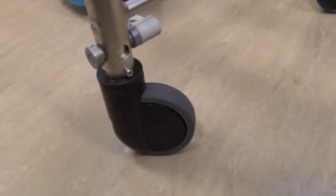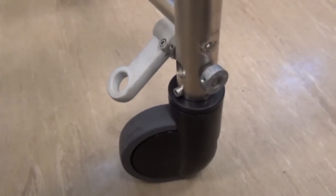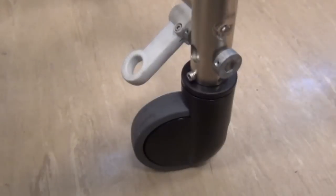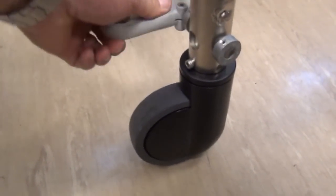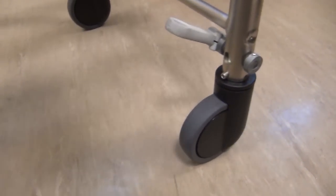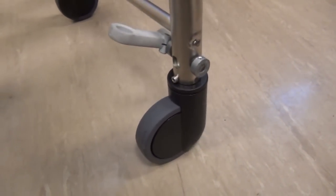The wheels of the casters are designed for rolling on smooth and rough surfaces and are non-marring. The casters used on the lift load have a lock steer feature for ease of maneuvering. The foot switch on each caster has two positions: one which locks the wheel entirely, and a second which prevents the wheel from swiveling 360 degrees. When assembling the end frames of the lift load, it is important to have the foot levers for the casters facing inwards, to prevent the foot pedals from breaking off should the loaded cart bump into a wall while transporting weights.